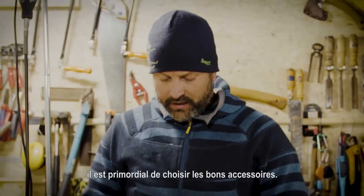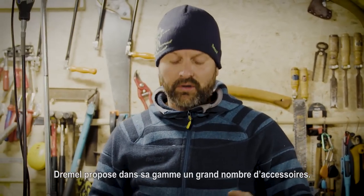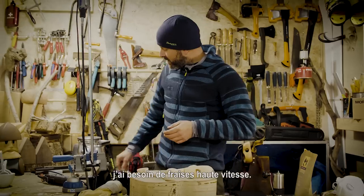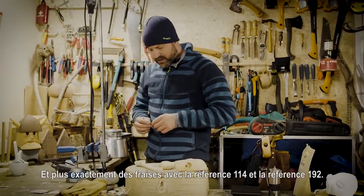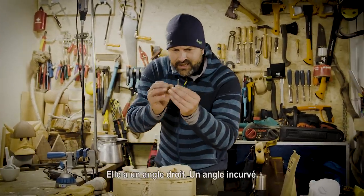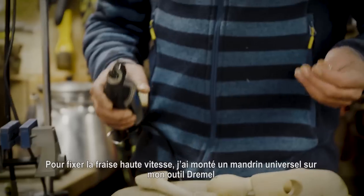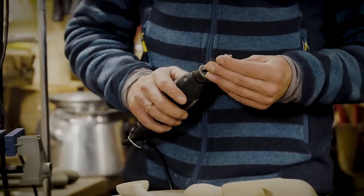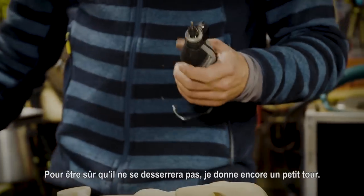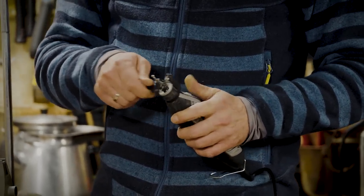As we do wood carving, it's very important to choose the right accessories. There are many accessories within the Dremel assortment. I actually need cutters that really help me with carving — it's called the high speed carver. The high speed cutters are number 114 and number 192. They've got the right curved angle on all the teeth. To attach the high speed cutter, I've got a multi-chuck on the Dremel, which makes it very easy to change. Put the accessory inside, just press and turn it, and give it an extra roll to be sure it stays on. Now it's fixated.